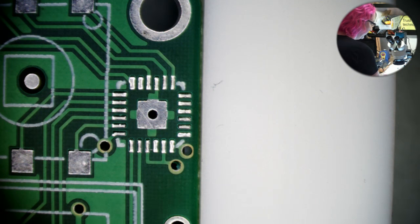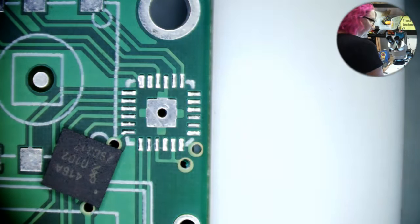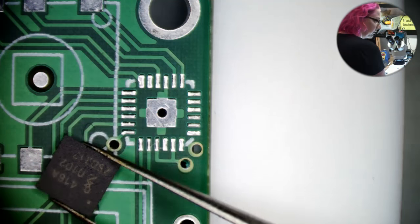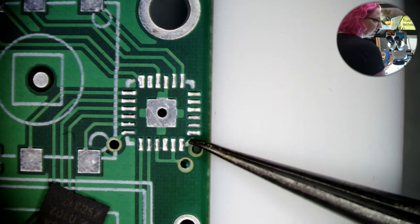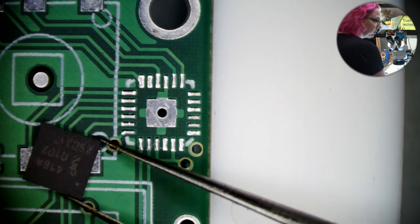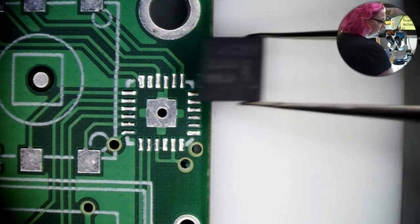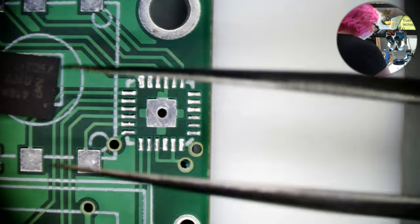This is that chip — this is the GPIO Expander. We'll put that together. It has a center pad, but the center pad is thermal, not a signal connect, so I'm not going to solder that part in. This is the chip, and to indicate pin one it has a little bit of a notch. You can see the NXP logo on there too. Looks like I got the right pinout.